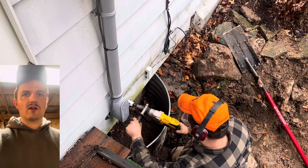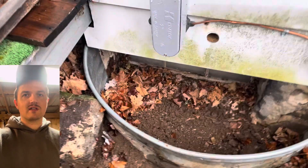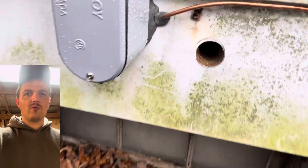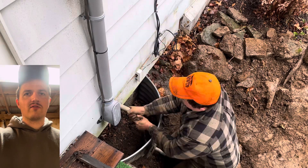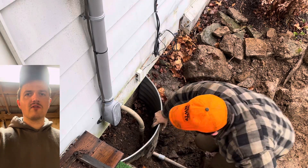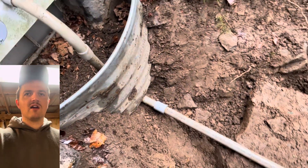Now I'm cutting a hole in my wall, which inherently makes you a little nervous as a homeowner, but that's what I had to do. Now I'm just feeding the wire and the conduit through the wall. Everything is framed together here. As you can see, I have my 90 going down — that's about two feet down — and I buried this wire.